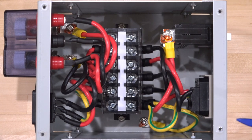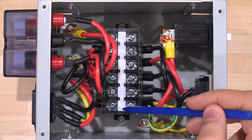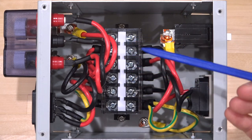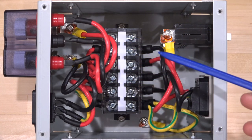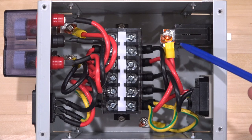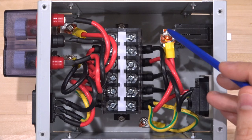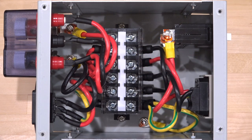Inside the ITE-185 accessory the build quality is very impressive. Everything is properly crimped, ground is properly connected, and there's a distribution center in the middle. This makes it quite hackable — you can remove and separate components without disturbing the other two halves. All interconnects have anti-loosening gel applied, shrink tube is in the right places, cables are the right length and gauge.